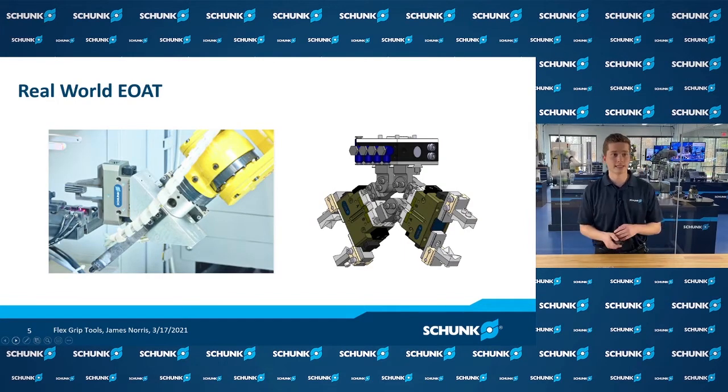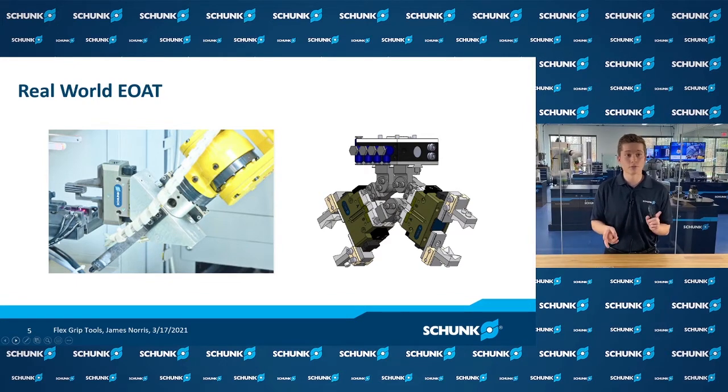Here we have another solution for a problem with two offset adapter plates that allows for two grippers in a machine tending application. You have direct hose-free connection to that gripper, so you're not dealing with hoses going back to your robot and to where you're controlling your valving. And here again we have a Flexgrip option which is essentially the same exact tool that will do the job just as well, but now you have something built standardly in a fraction of the time.